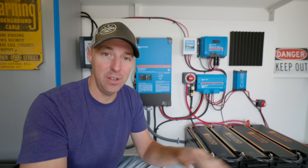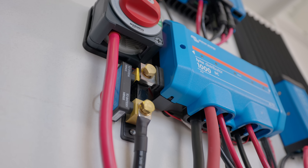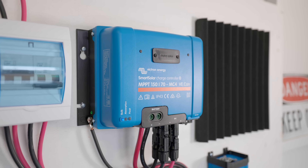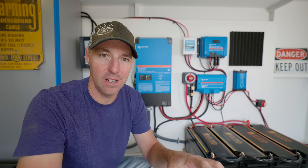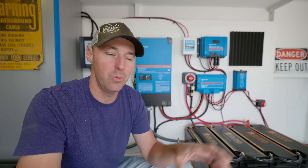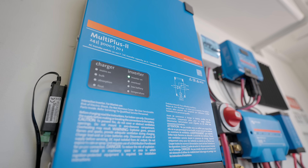I'm not saying this is the best inverter for every situation, but looking at what's out there, this has to land in my top two for best inverters for RVers. The 24 volt version means less amps, smaller wires, smaller fuses, easier expansion, and more output from your solar charge controller. Victron is a high-quality, extremely efficient inverter with countless ways to customize it and set it up remotely. The cherry on top is the power assist feature — whether you're on 15, 20, 30, or 50 amp shore power, you've been able to run the AC and power assist to wherever you need. I think it makes it the most flexible, usable inverter for RVers at this time.